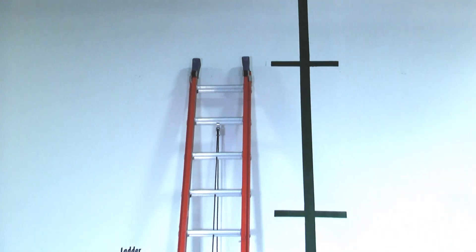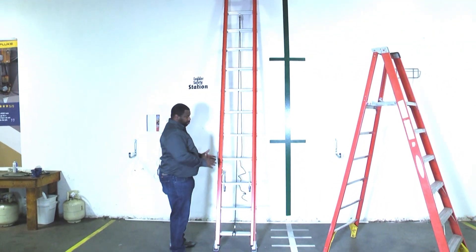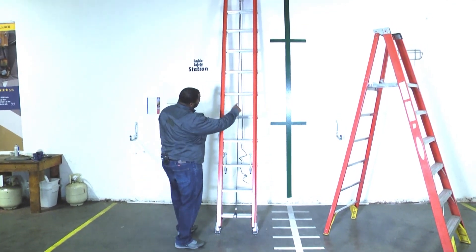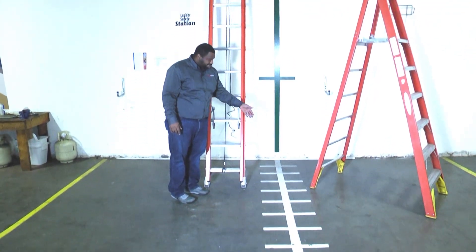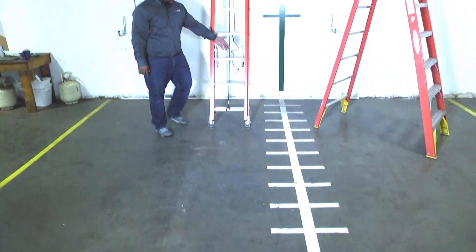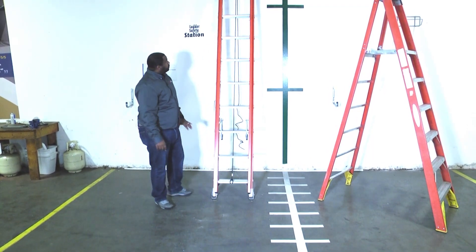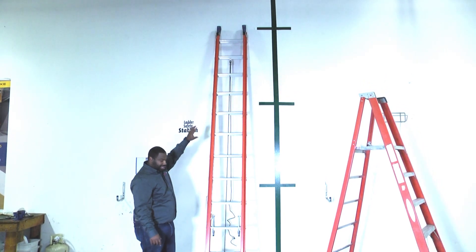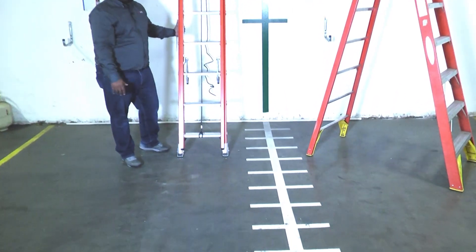The second is the four-to-one rule, which says for every four feet up, I want to bring my ladder one foot out. We have it marked on the wall here that you can see, in four-foot increments, and on the bottom we have the one-foot increments to tell us how far that has to come out. I'm a little beyond the third foot out there, kind of halfway in between, because my ladder is not quite all the way up at the top — I just wanted you to be able to see where the mark lines were.